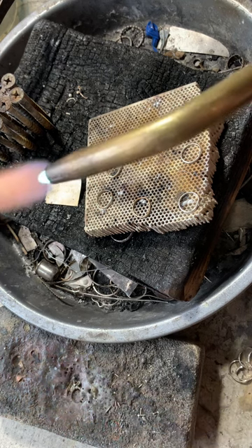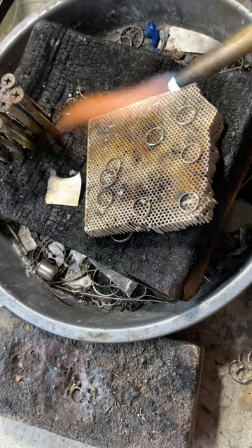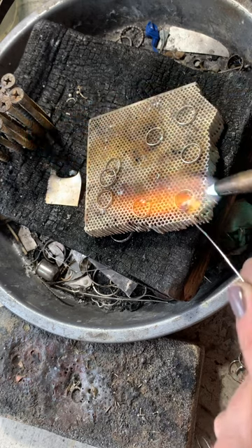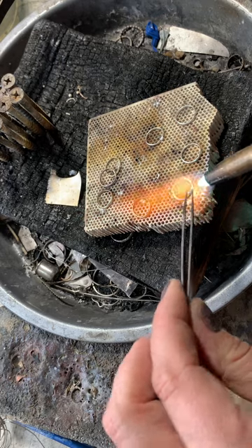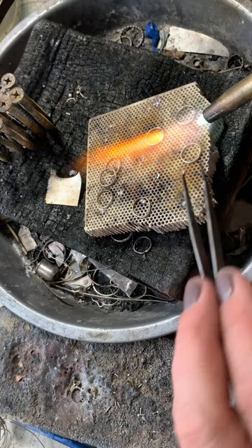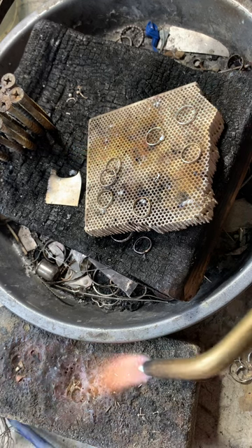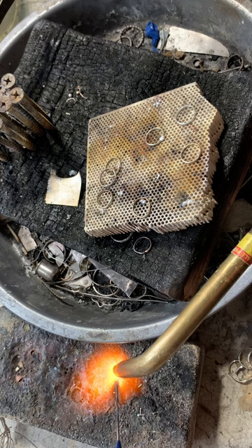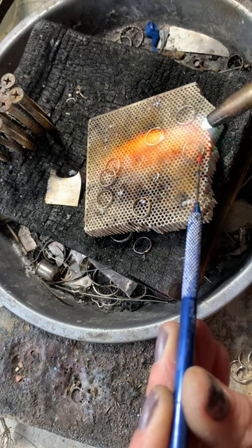Sometimes if you heat it — there we go — now it's all the way around. Another way you can do it is just tapping it. I don't like doing it really like this because see how it balled up like that — it can get too much solder. And that just messed up that one, so we'll just get rid of that. I should have let it get a little bit warmer and then done it. I just don't really like tapping solder when I'm making chains because you can't control how much you're putting on.